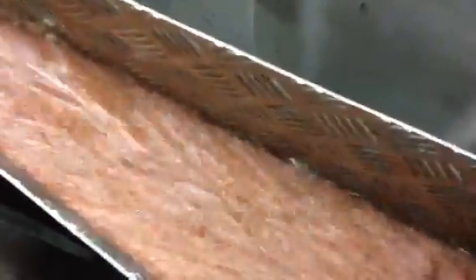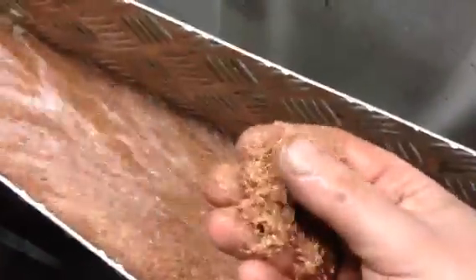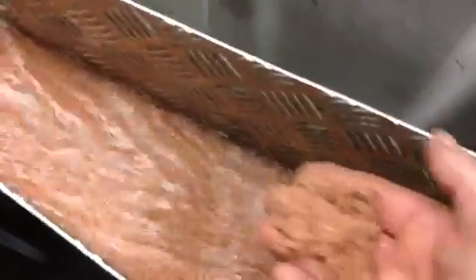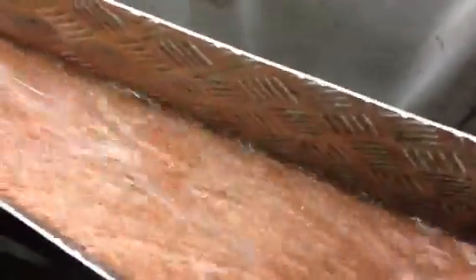That's how it separates. The best way to separate it is to chop it as fine as possible. Then the size of the copper wire and the plastic is roughly the same size. So the copper is obviously heavier and more dense than plastic, so the plastic will get washed away.